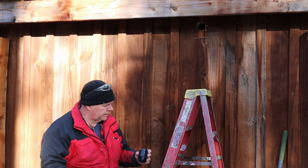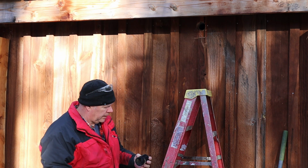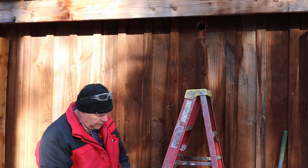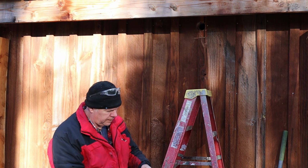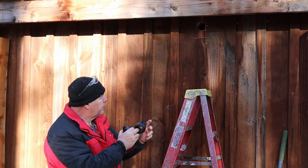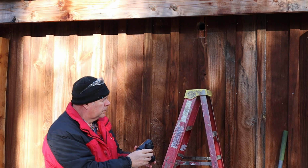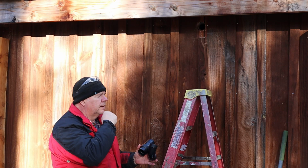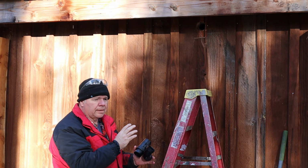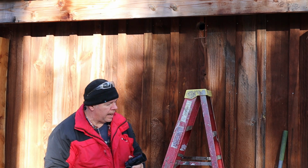So what I'm trying to achieve is, this is the piece that came out of that wall, the vent piece, and I'm going to try and put a bell reducer on, a short piece of 1.5 inches. I don't know how short, probably only 1 inch long, and then this goes into the wall for the vent, and then make that transition up. When I did it, I'll show you some of the stuff I did off of video, it comes out to be about 3.5 inches. So it's going to actually be a combined deal. I'm going to have to modify this and then notch the back of that.